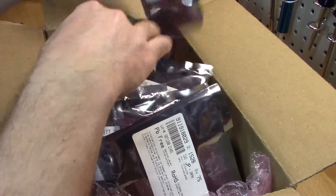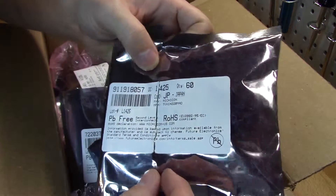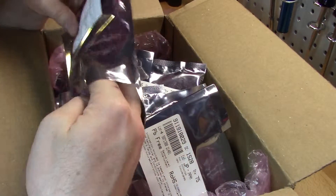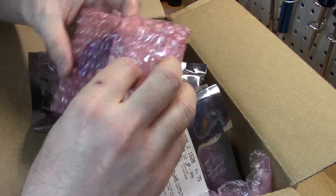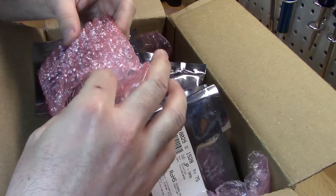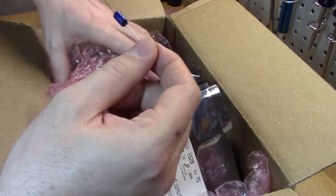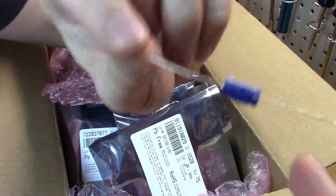I did peek at one of these — I opened the one with the oldest date code. This is the one pack that's a little bit older than the rest; it was marked 1425. However, I tested the capacitance and they were certainly within spec. They were really close to their marked values, which is really good because typically capacitors have like a 20% tolerance on capacitance rating. These 22 microfarad capacitors read out to be 21.5, 21.9 — really darn close.